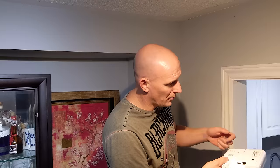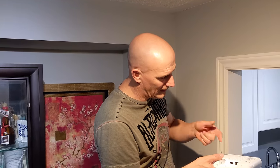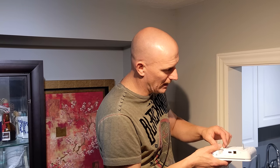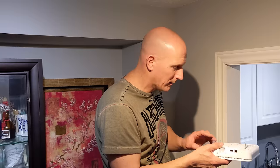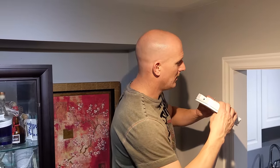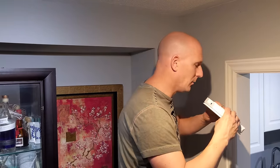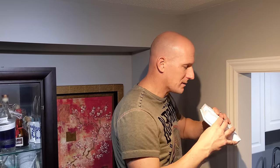I'm going to take the base station and install it first before continuing on the phone, because this is definitely going to be the first step. You're going to have to put this on the wall or on a table wherever you're putting the base station — this is the brain and siren of the home security system. I'm just taking the back of the base station. I have two screws — any kind of flat pan head screws. I'm going to put a little pressure on the screws, press the base station against the wall, and just press a little bit to make a mark on the wall — that's where I'm going to drill. It's a little trick to make it quicker.